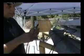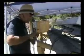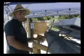Now we're going to interconnect. We're going to leave the positive of module one unattached for right now. Plug in the negative of panel one to the positive of panel two — this is a series connection, positive to negative. Then the negative of panel two to the positive of panel three. Now we've just tripled the voltage.